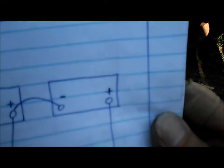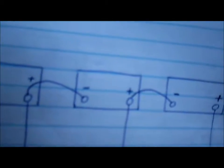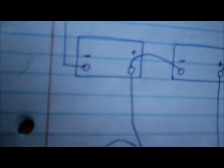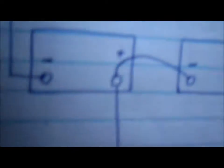What we've got — the first battery going to our 12 volt terminal — isn't a complete circuit because it loops to the next and then loops to the next. So this is actually backwards. The way this is hooked up, we are at 12 volts because you've got the ground going to the motor and you've got the positive going to your terminal, that goes through everything, back up to the motor, completing the circuit. So this would be 12 volt, this would be 24 volts, and this would be 36 volts.